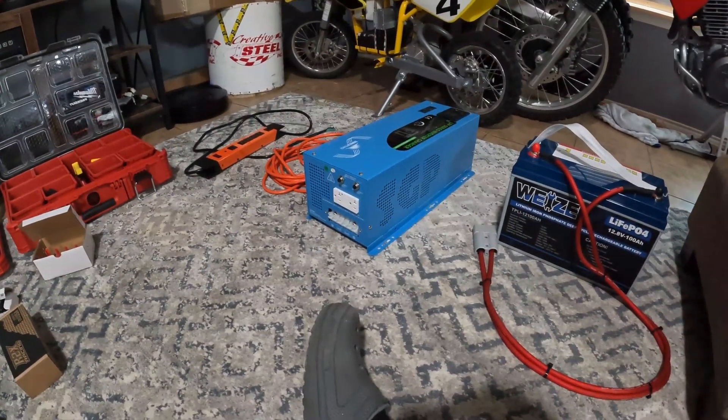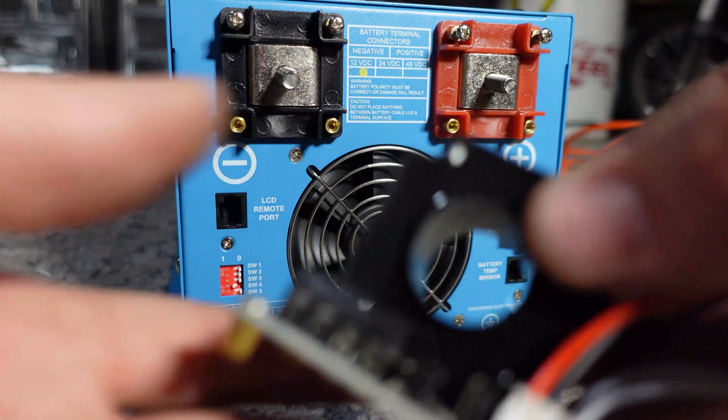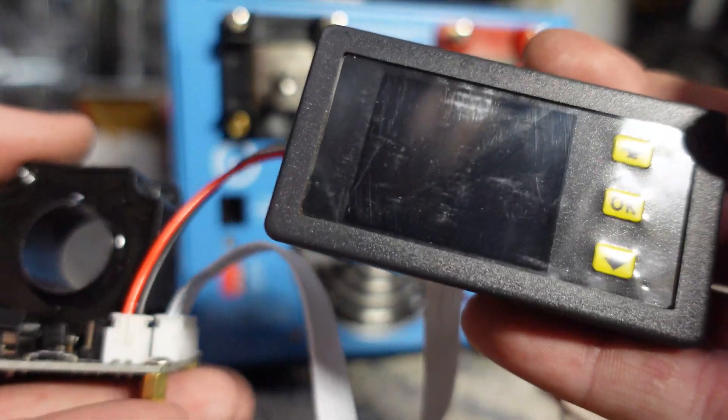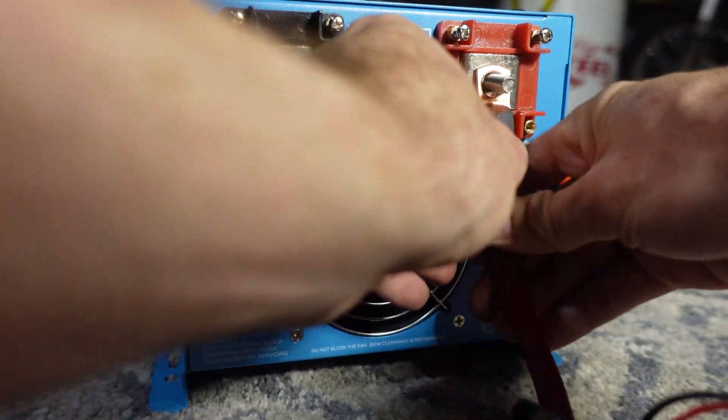Alright, I've got the camera on the Sony now. So we're going to hook it up — this is our current shunt and we're going to use this little display. All I have to do is give it power and it will turn on and tell us power going to and from the inverter. I'm going to stick this on the positive end with the arrow flowing toward power.